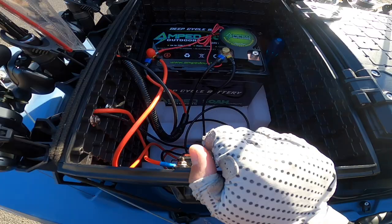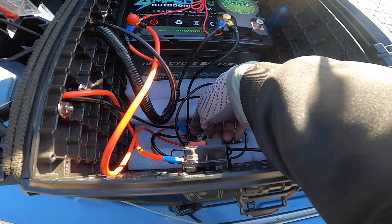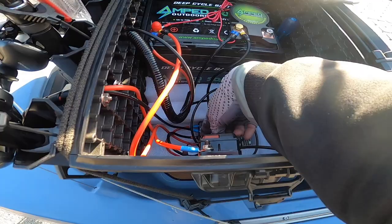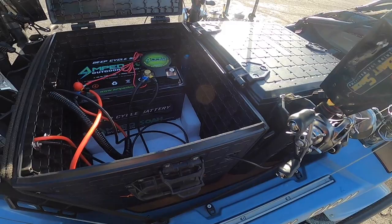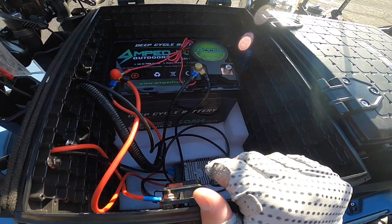One thing I would caution is when you charge the battery, I always unplug these. If I have these plugged in and plug the charger in, it might over-shock the voltage on these components. It's dangerous to run the 12-volt side at, like, 17 volts — you could definitely break your MotorGuide with a high voltage like that. Either that, or you could run two separate batteries, which is probably the safer route. I just wanted to reduce extra weight on the back.